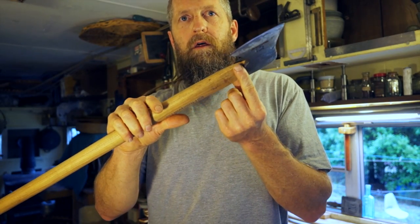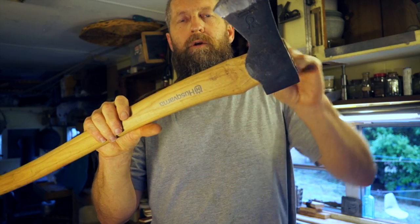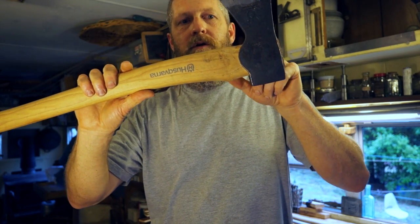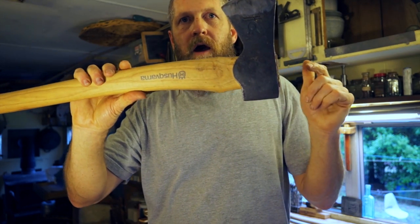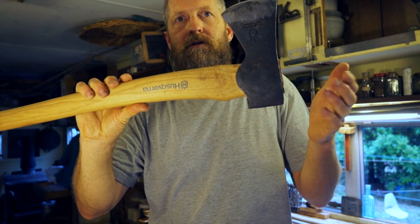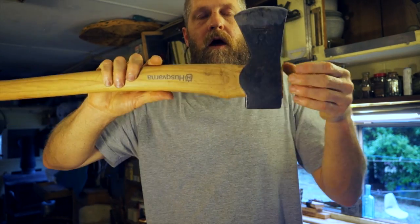This area is extremely sharp because this axe head has a sharp V in the eye — it comes to a sharp V rather than being rounded off. You can imagine how vulnerable that is — a sharp piece of wood hit with something will break much easier than a rounded piece. That's a really important reason why this head needs to go on further: to cover up more of this sharp edge. I hit this on a branch in the dark and it's already damaged — it'll splinter and splinter until it rounds itself off effectively, but by then it'll be all broken and messed up.